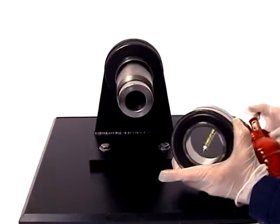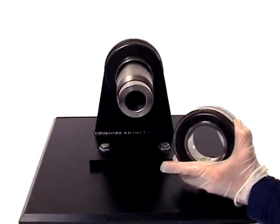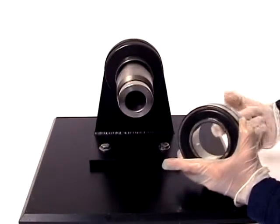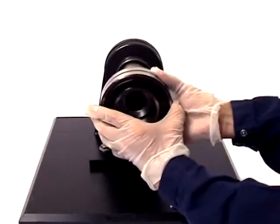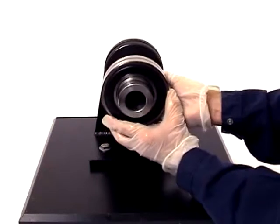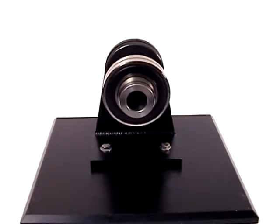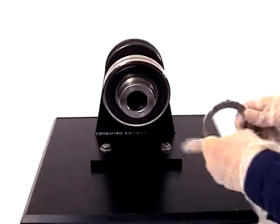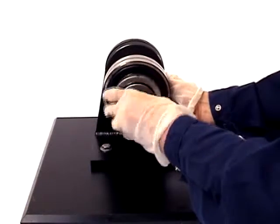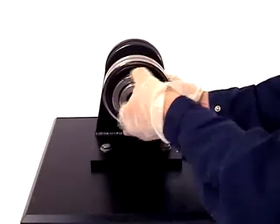Be sure to apply a thin coat of light mineral oil so that the bearing is easier to mount. Push the bearing up onto the sleeve until the bearing just makes full contact with the sleeve. Then, with the chamfer facing the bearing, run the nut up the thread until it contacts the bearing. Continue to tighten the nut, just enough so that the self-locking sleeve makes full contact with the shaft and the sleeve is firmly in place.